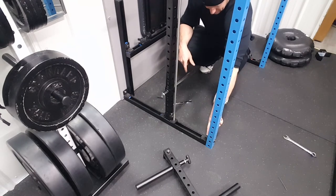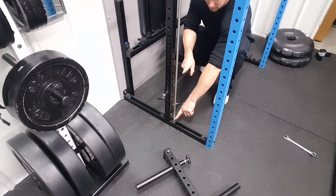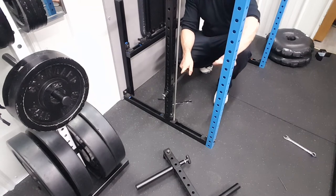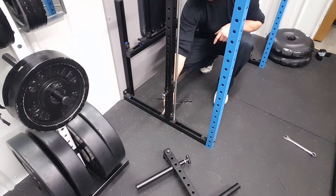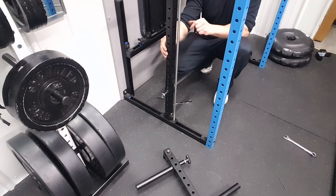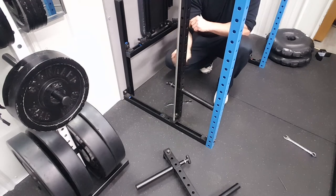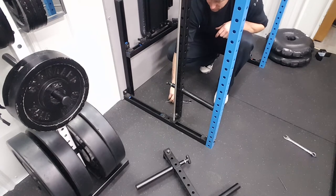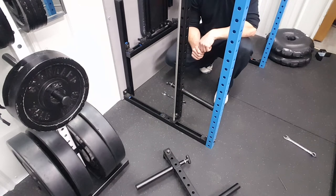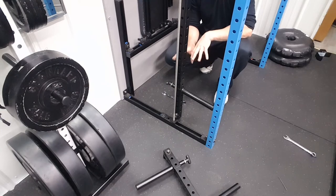I'm going to take this down 11 inches to the center — now I've got the same gap. Just tighten this down; it doesn't need to be super tight yet. One thing to look for: check which direction these posts are relative to the rod. I want to make sure the other side matches, so when it's like this, the post on the outside facing upward slightly will match. Then I'll repeat the process on the other side.